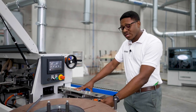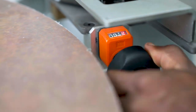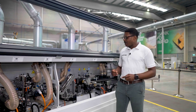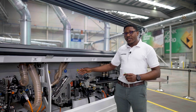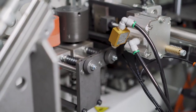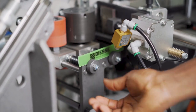This is an op that I'll be using and I'll be going to 2 millimeters, going slightly over to begin with, and then back down. Next up, I'll need to adjust my gluing unit to suit my 2 millimeter material. I'm currently using a material that is 1 millimeter thick, so I'll be removing that and adding the 2 millimeter material and locking it in place.